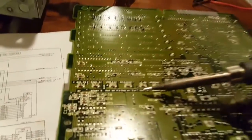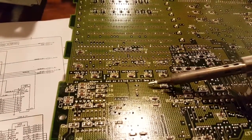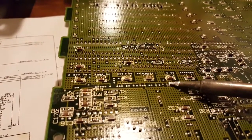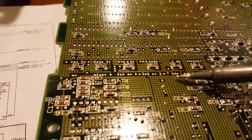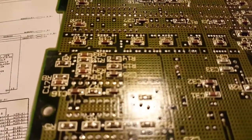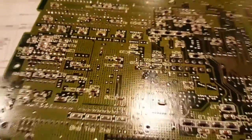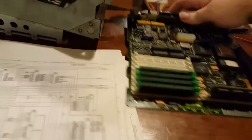We're going to try to do this without any video editing. We're going in here to try to clear off the solder blob — that's working. Let's clean the tip and get a little bit of flux to pull that solder up and out of the way. That should clear the short — and yes, it does. Let's turn the power off and try it out to see if that makes a difference.